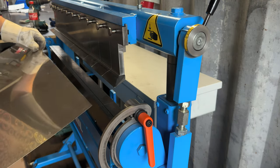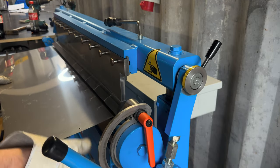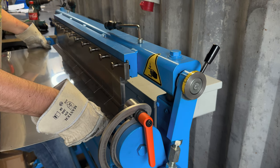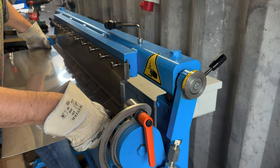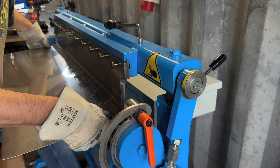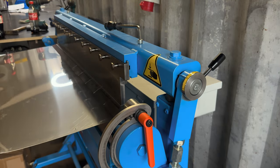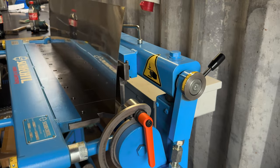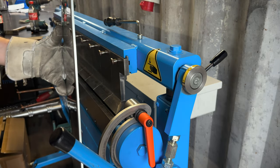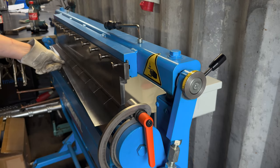The next step is I'm going to fold this five millimeter edge 180 degrees and then squeeze it. So first I'm going to fold it five millimeters - I'm going to put it here on 0.6, 0.5 thickness. So I have here now an edge of five millimeters, and now I'm going to put it right here.